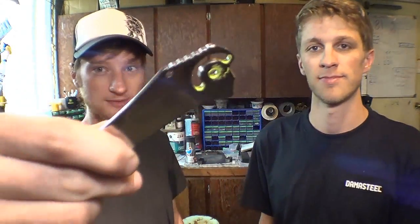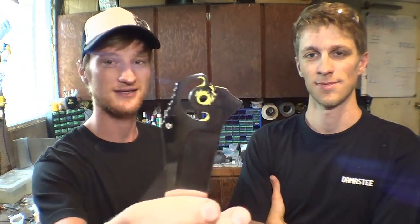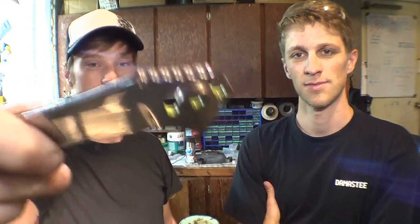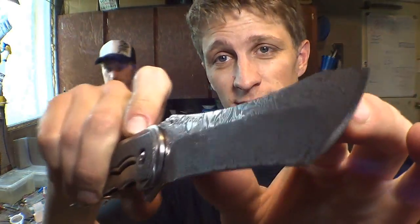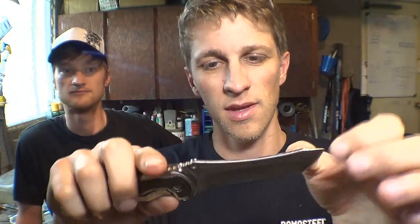First off, you've got to nail polish it — protect the good stuff. The reason you nail polish is so that it doesn't get etched where you've already cut the lock bar and polished the pivot and the stop pin track and everything — all the super important parts. And this is our new etch. Super contrast — super black and white. We absolutely love the new etch. It's just kapow. Before it was silver and light gray, and now it is silver and certainly dark gray.